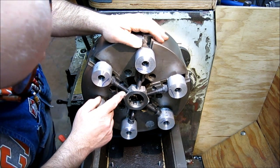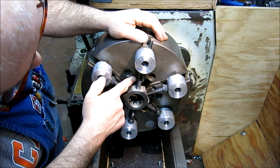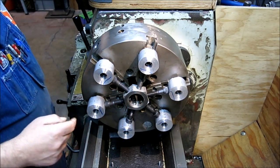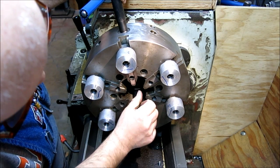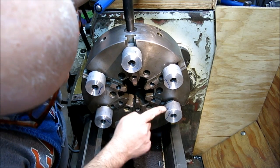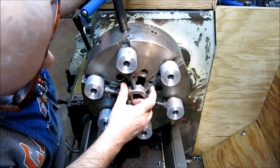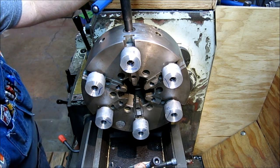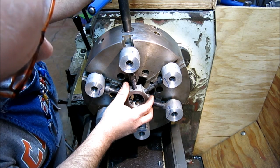The other thing I noticed is this hex is very close to the inner diameter of the jaw, so I can actually take these bolts out and put that in the actual jaw — in fact let me take it out so you can see that. I could put something in here too, which preloads that jaw outward. It's a little better to be on the thing that we're boring, but if I want to make a deeper recess in here, this might be in my way. I could use a piece of all-thread instead so the head would be a little smaller. Anyway, that's how you can preload the soft jaws in the direction that you need to bore them.